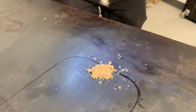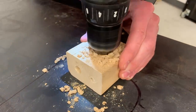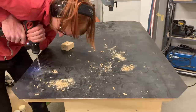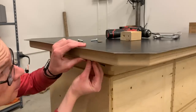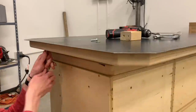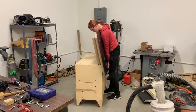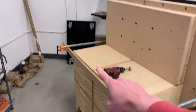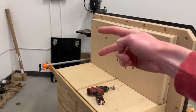At each of those mounting locations, I drilled a hole through the pan and then used a block to guide the drill straight through the MDF. I installed the rest of the bolts that hold the pan down. I'm here by myself today and not strong enough to pick up this whole thing by myself, so I just tipped it up and added some clamps for security so I can counterbore the holes where the lathe foot bolts will come through.